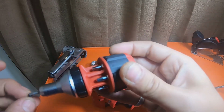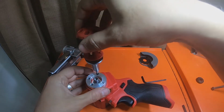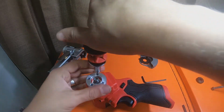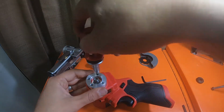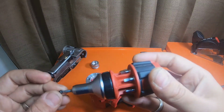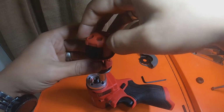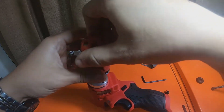Alright. With this guy right here. Right there, dropped in. That just makes sure that the screw goes back into the hole in the threads that it was threaded originally in, because these are self-tapping threaded screws. So if you don't get them back in their direct original threading, it will create new threading, and you'll have a bunch of problems. And you'll end up stripping the plastic out, and you'll never get it back in. Or you'll never be able to use these screws again.